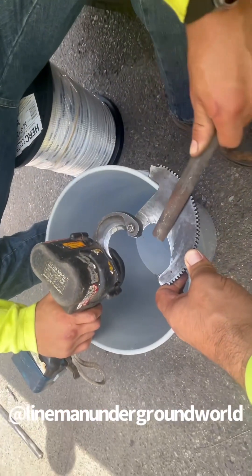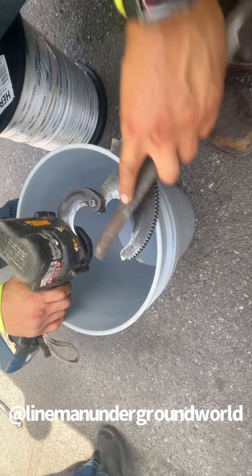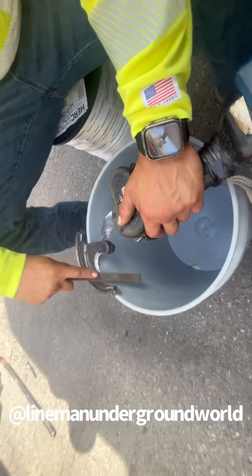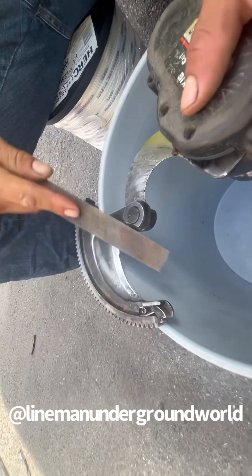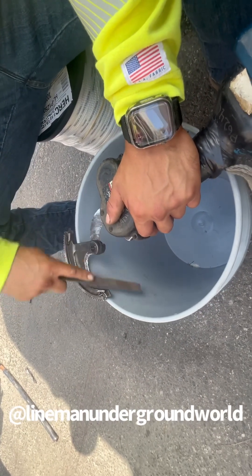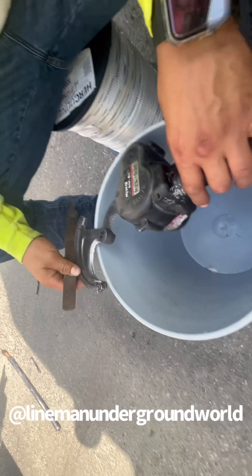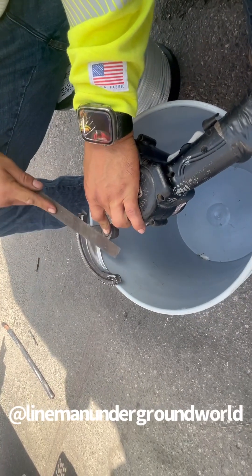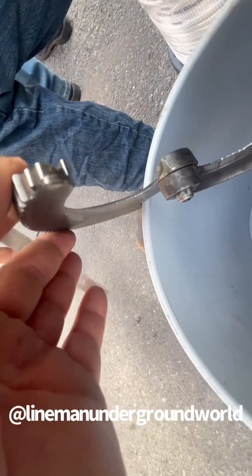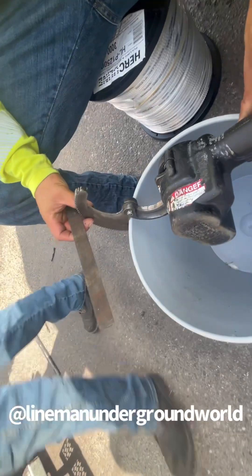That's the way you keep your robo cutter sharp. We're gonna do this side — it's still kind of messed up over here. We rolled it over to hit the other side and try to bring those two edges a lot closer for a sharp edge. Just a little elbow grease, a little experience, and working the file — she's gonna be sharp as a knife again. We turned the side so we can see how sharp we're getting the edge, which is coming along real nice. It's sharp, it's cleaning up a bit — it's not gonna look pretty but it's gonna be sharp.